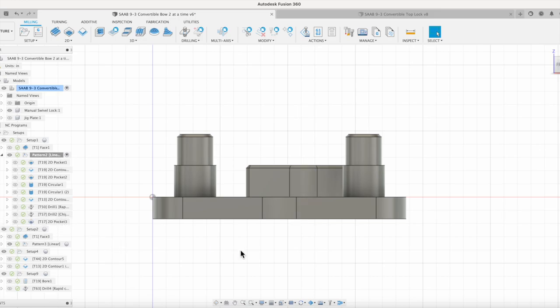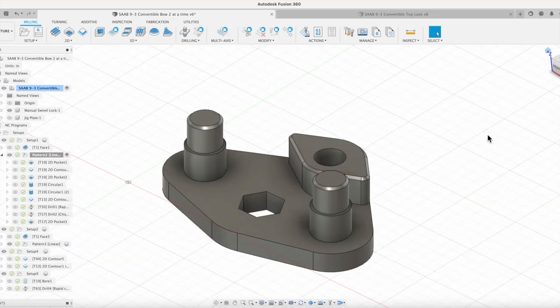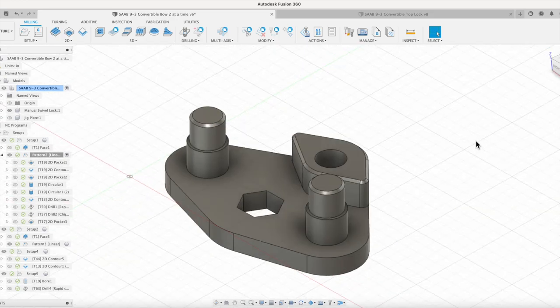For right now, I'm going to go ahead and we've got our part flipped over. I'm just going to add a step in where we're going to drill it from the backside before we counter bore it. So we'll just add that step back in manually to take care of it for this time. And we have fixed this for future production of this part. Let's head back down to the machine. Let's get these holes plugged in there.